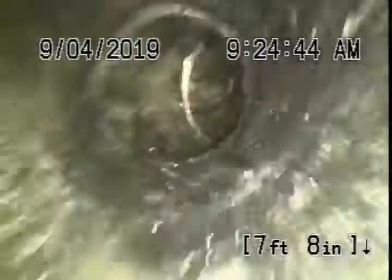You could hydro-jet the line and clean it out periodically, but it does have some pretty heavy roots in it. Either that, or you just replace it. The piping at the back underneath the concrete has heavy roots from the guest house and from the main house — it's going to have to be replaced. You can either replace it or hydro-jet it periodically. There it comes out of the clean-out, and we'll stop the recording here.